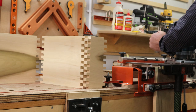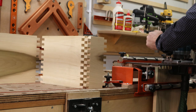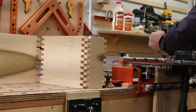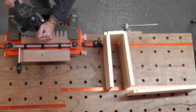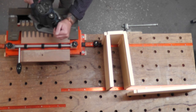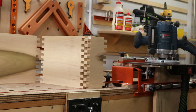Sometimes on a piece of timber you'll find that, you know, the colour is nice, looks lovely. But often that coloured area, and I do find it on tulip, that coloured area machines differently, feels more dense, and you can feel it in the router. Doesn't glide through smoothly, you've got to slow down a little bit, give it time to come. Pretty much a feel thing, and the more you do this sort of thing, the more you get used to that sort of stuff. Often, you know, a beautiful piece of wood will take more cutting, more machining.